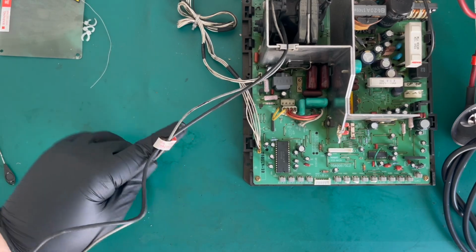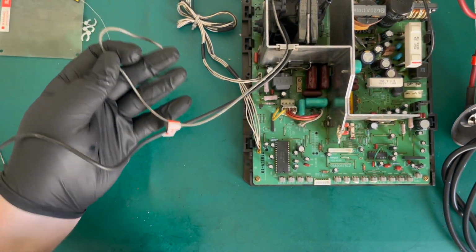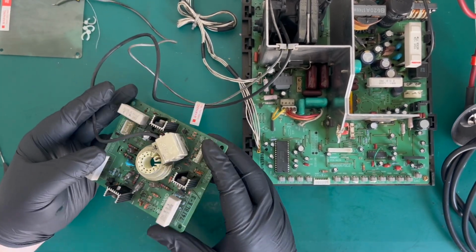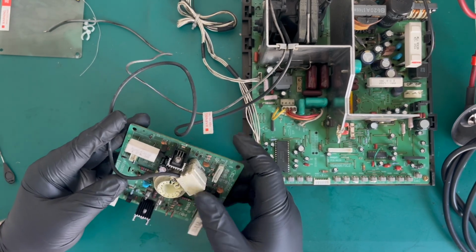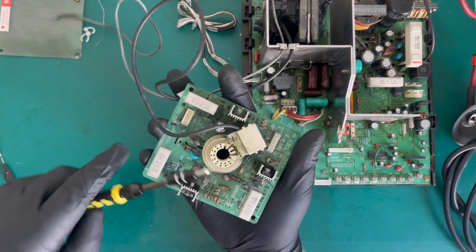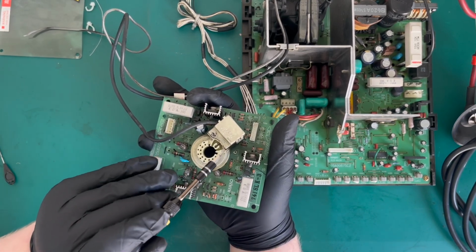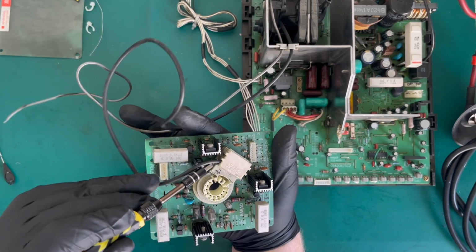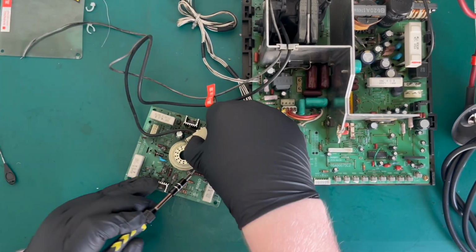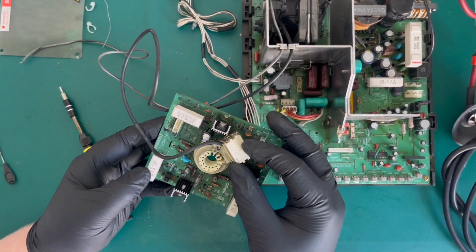So it's just the focus wire to go now. Are they label stuck together? Yes, they both go through a high voltage label. So the focus wire, it's going to be similar to the MS8, similar awkwardness. You've got two sort of plastic tabs on each side that you just need to flick open. So that's probably flicked open there. That's probably flicked open there, and then you just want to try and open. Might be easier if I just... Yeah, there we go. And that's that open look, and it actuates backwards.